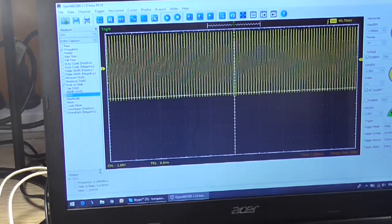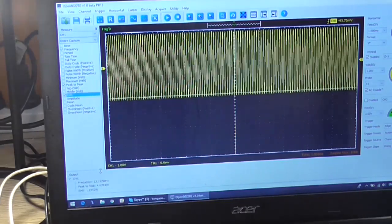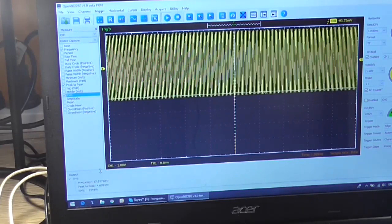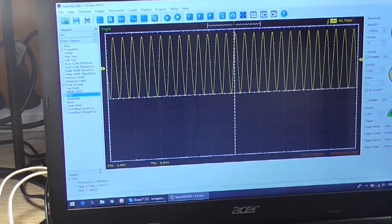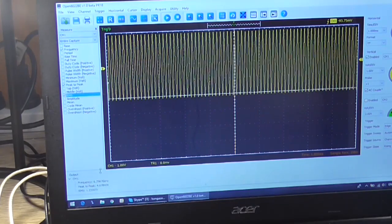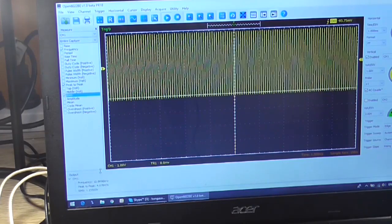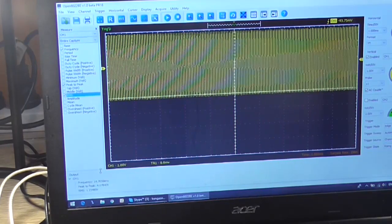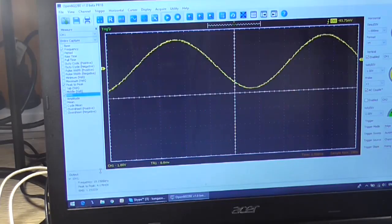So it's definitely no good for RF circuits. Let's just get that straight. If you want to breadboard an RF circuit, forget it. Use a piece of copper clad and cut out with a knife or something breaks in your tracks where you want, and dead bug solder all the components to the copper clad, or etch a board, whatever, and just make sure you've got a good ground plane. RF circuits can be built and tested that way, but not on breadboard.